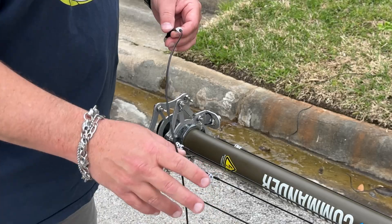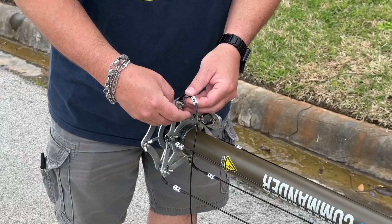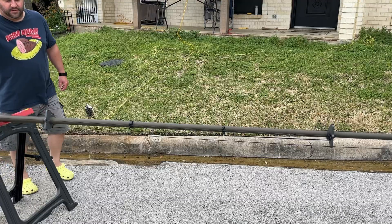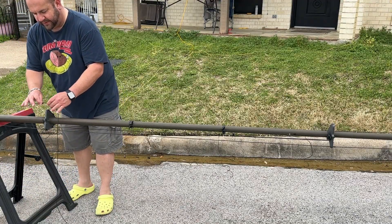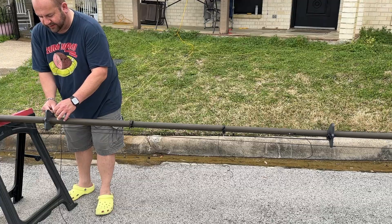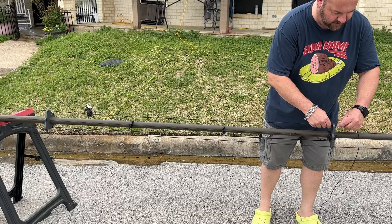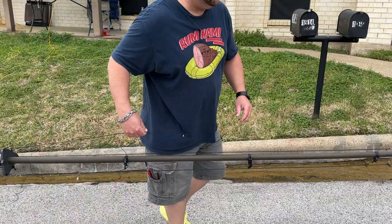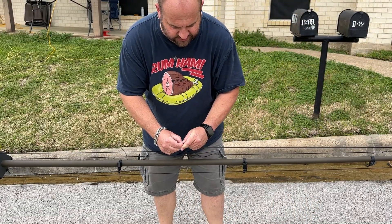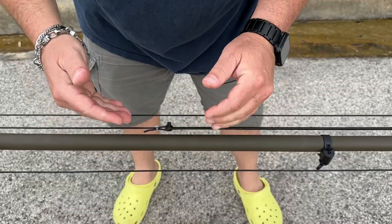To set this up is easy. I like to start with the shortest wire first, but just for demonstration, this is the 17-meter element. We simply slip it underneath the wing nut and washer, clamp that down, and then run the wire up. I've got some heat shrink on here, so before the heat shrink, we just put the wire in the slot, pull it up — and the heat shrink prevents the wire from popping out. Then we go on up to the next spreader, same deal: pop the wire in, pull up the heat shrink. Then from the top spreader, I've got this doingy, and you simply insert it — you make a double knot and insert that through your loop, and that is what holds the elements up.